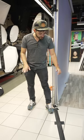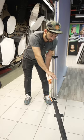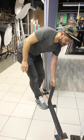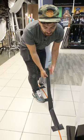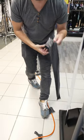And bonus points: if you step on the tabs that you left underneath the perpendicularly laid tape, you lift up, stepping on each one, preventing the cable from lifting up and any tape from wrapping around the cable.